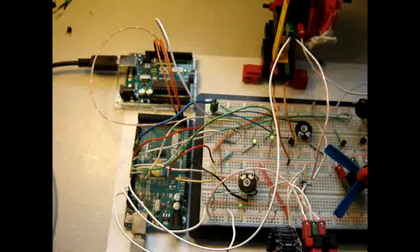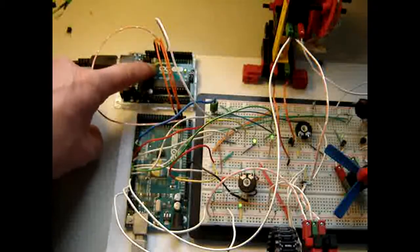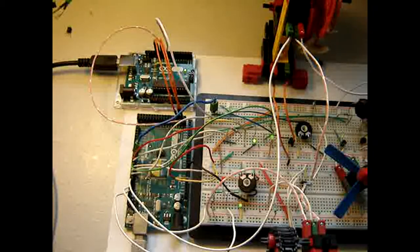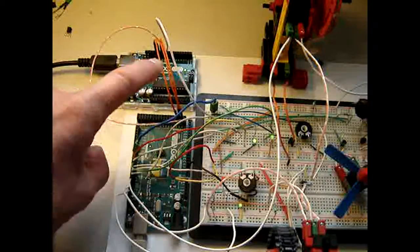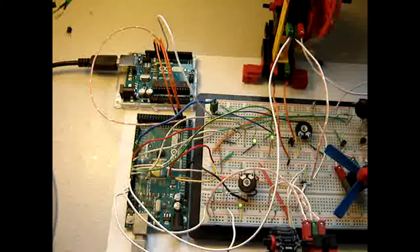The original idea, encoding of the SPI, I had to let it go to see why this onboard LED would work and this one wouldn't. So I changed it by making sure that when some value around 500 is passed here, the LED goes on and this one off for 1 second, and then this one off and this one on for 1 second.